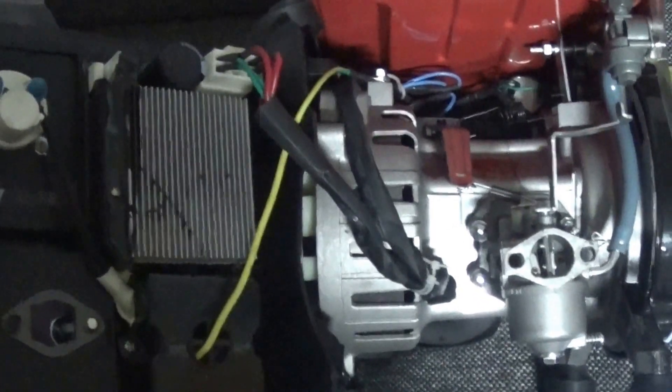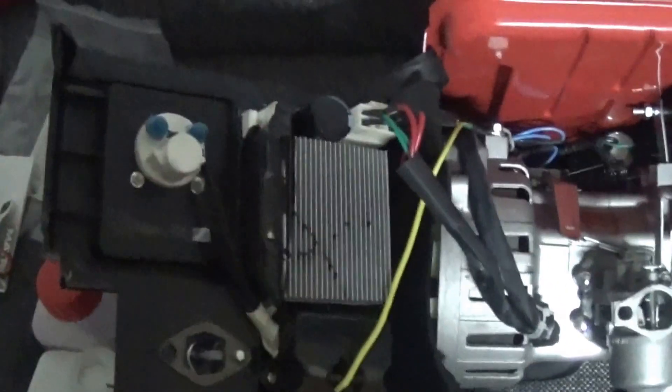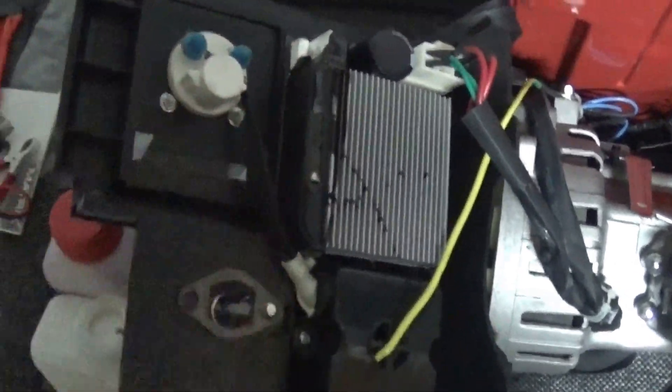So it's pretty much the same thing internally, except the generator inside produces 12 volts, which then gets boosted up to 230 volts at 50 Hz. Everything is properly grounded. Simple construction, but utilized a lot more intelligently — this is definitely the best thing you can get if you want an affordable generator. Minor complaint: there's a bit of epoxy spilling onto the heat sink, but it's only a thin layer so it should be fine.